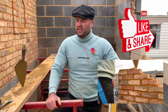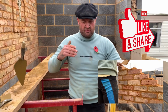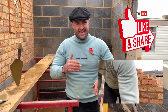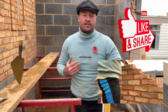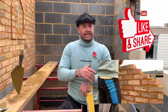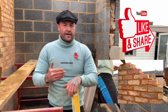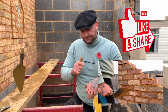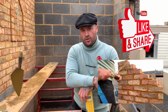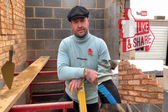He passed away, I think, in 1924, something like that. But his method and his terminology of bricklaying and what a bricklayer should be was passed on. And I was lucky enough, and I didn't realise how lucky I was until lately, really, how good my mentors were who taught me the traditional way of how to lay bricks. Now, read this quote. He says in it, a good bricklayer only uses the plumb level, which is your level, after 3 to 6 courses.